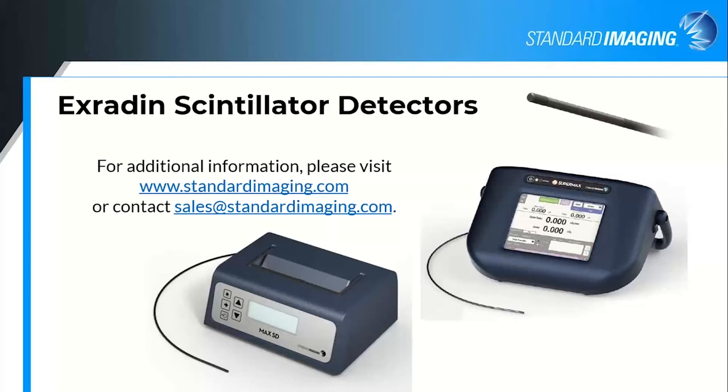There is one question: what about holders for scanning? If you buy the W2 kit, we send it with an acrylic sleeve that has two different diameters — seven millimeter and eight millimeter — so that it should fit any of the standard chamber holders from any of the water tank scanning systems. We've had success with it for every vendor. The adapter sleeve allows you to get the scintillator a little bit further away from the mechanics of the scanning arm, and it also allows you to clamp down on it with your chamber holder to ensure it's not going to wiggle around without worrying about damaging the optical fiber.